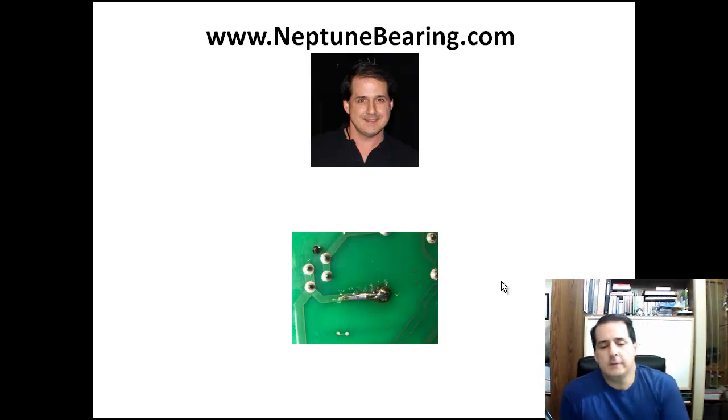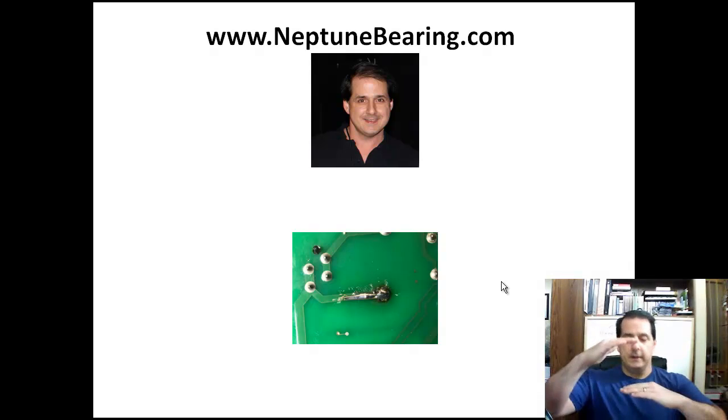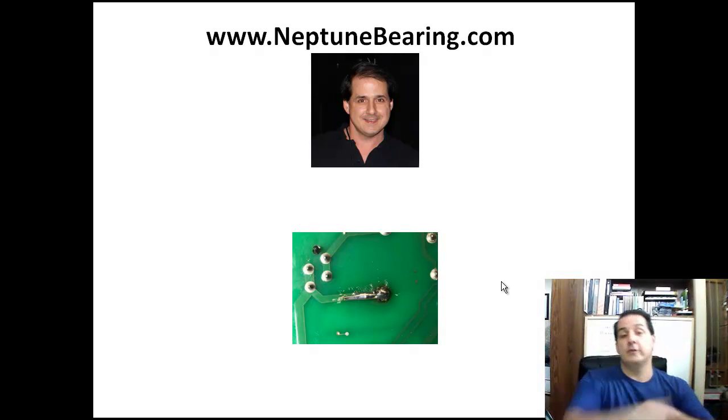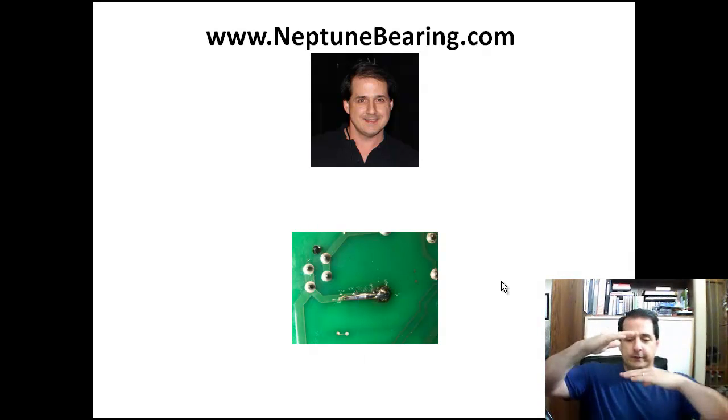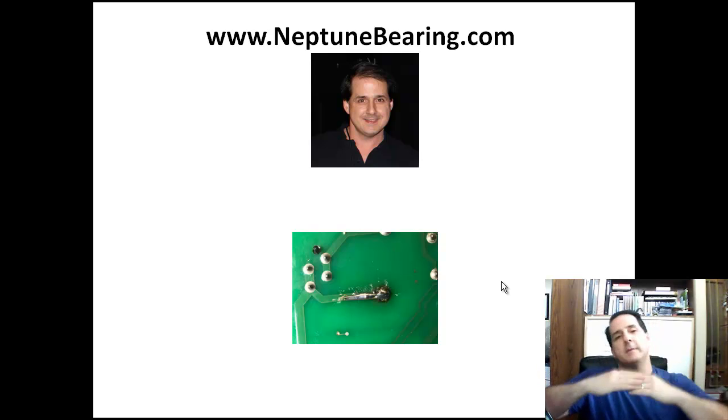The relay failed. Just over time, every time you start the washer, or the dryer I should say, the relay closes, which connects the power to the motor. And when motors first start up, they take an inrush. Okay, there's a lot of current. It may take 4 or 5 times inrush current. And so as those relays bounce, it can arc. And over time, their contacts get pitted.